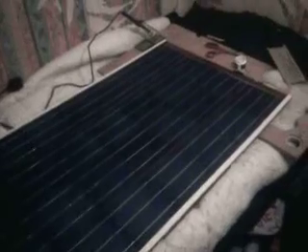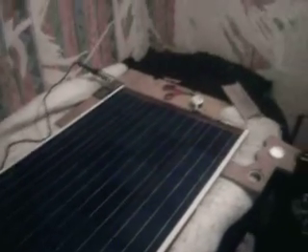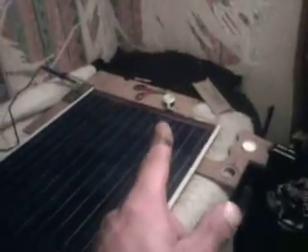The extension cord's up on my bed. Good old soldering iron — only 35 Watt, but I've done all this. I didn't need a 700 Watt really powerful one, and it's gone fine. Just got a little bit of flux paste there — that's for piping. I run the tip to swill it around right in the tub, and because of the flux it picks up off here; I've always got solder on the end. So I always have to swill it around, dunk it in that, blast off any little bits, swill back around in there, and then carry on.